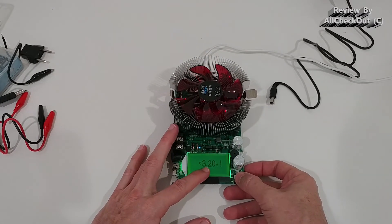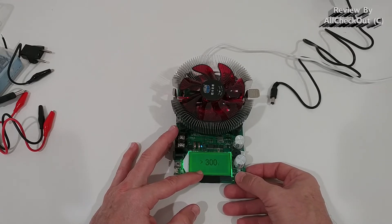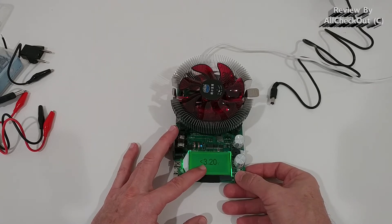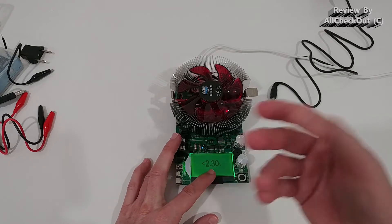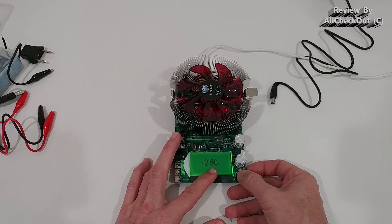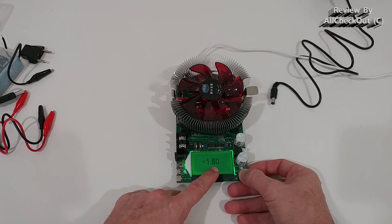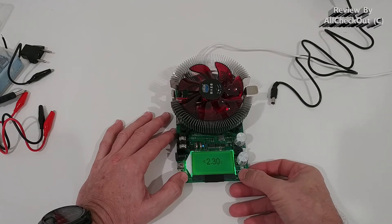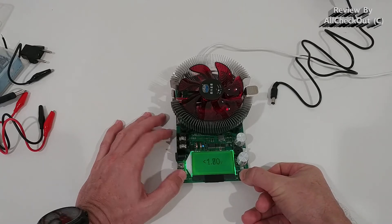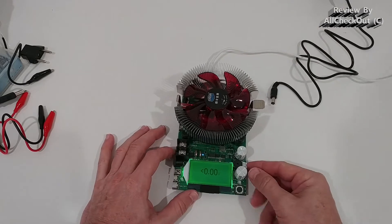I got a little bit in trouble — I have to reset the low voltage warning. When you press slowly about six times it goes into settings where you can set the high voltage warning and low voltage warning. How the navigation works: pressing two times increases, three times decreases — this sets the direction. Then you long press and it will automatically move in that direction. Keep pushing and it goes up; press three times and it goes down to zero. The description is very simple — I wish there were a better explanation.